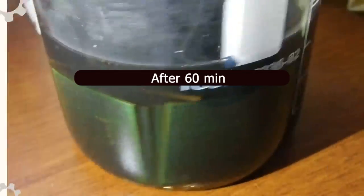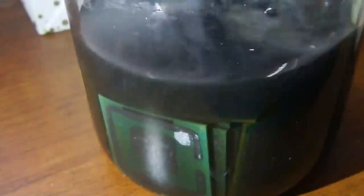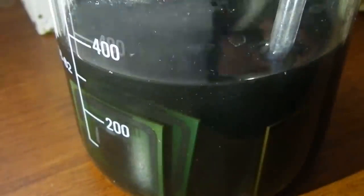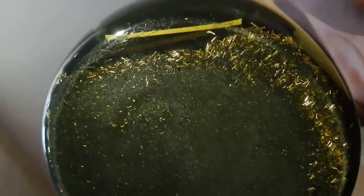An hour has passed. Look — all processors are literally 80% without pins. The solution turned black, and it became black for a reason: gold was released from the solder. Tin has dissolved, gold does not dissolve, and it fell out into the solution. The black precipitate at the bottom is mostly gold, along with all the contacts. I'll leave it for about half an hour more, then rinse and do the settling.